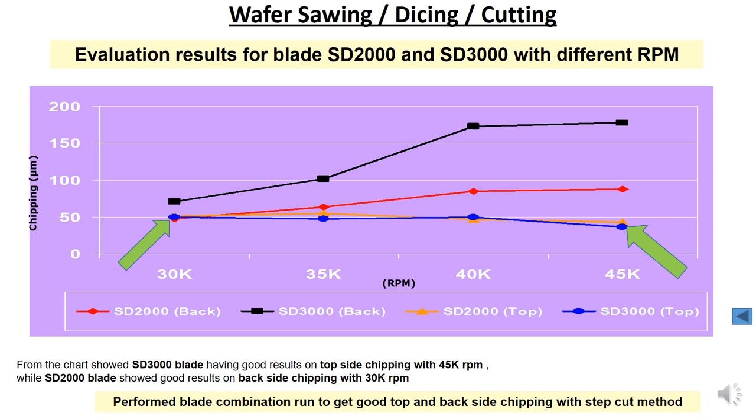SD3000 topside chipping in blue label, you can see that the higher the RPM, the lower the chipping. However, at 45k RPM, SD3000 topside chipping, which is labeled in blue, is much lower than SD2000 for the topside performance in orange. So we can conclude that SD3000 blades have a better performance in terms of topside chipping